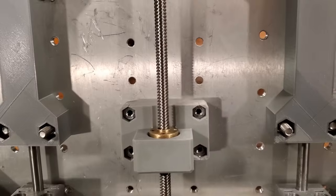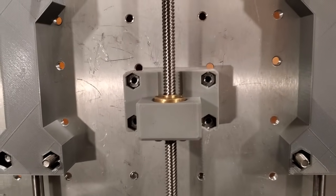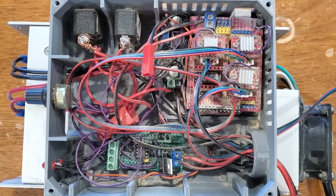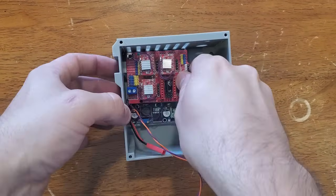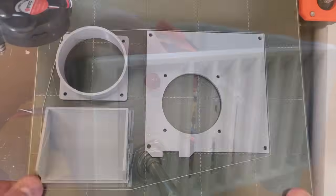After threading on the new y-axis carriage and screwing it in, I was finished with the mechanical parts so it was time to take care of electronics. When I cracked open the electronics box, I found it was totally caked in sawdust. Being mounted above and behind the spindle and sealed up better should help avoid this issue with the new electronics box, because if these were conductive aluminum chips, they'd have totally shorted out everything.